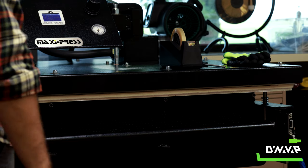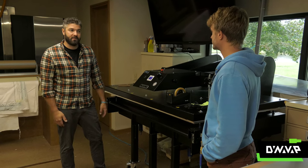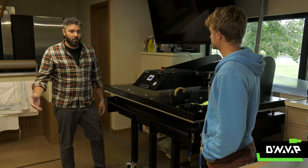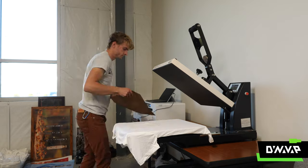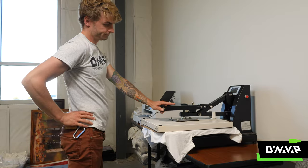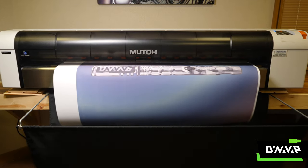Our paper won't have the tack like yours does, which helps bond to polyester. We want to be nice and smooth because we're using a smooth aluminum substrate. Our time is probably a little longer than you use for t-shirts, and our pressure is probably a little different, but ultimately the sublimation process for shirts or any other substrate is exactly the same. My t-shirt process is definitely a lot simpler and faster — I can make about 10 t-shirts in one hour, while the printing alone at Lumify took at least 15 minutes.